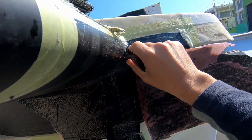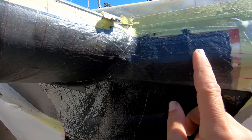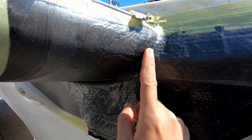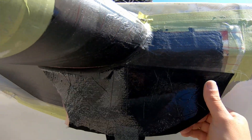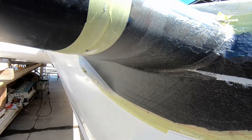It's done a little bit of wrinkling here, but not too bad. You can see the extra patching that I put in the corners where I nicked the carbon — so there's an extra layer of cloth that went over it, and you can see the build-up of the stacks. Generally it's come up quite nice — a nicely finished vacuum bag part. Pull the peel ply off, give it a sand up, and she'll be ready to be covered with paint.